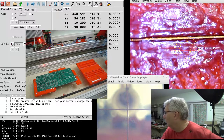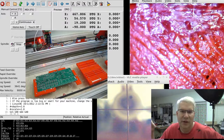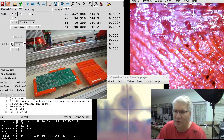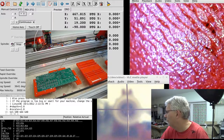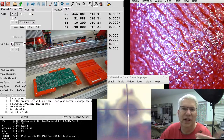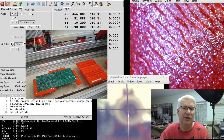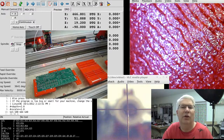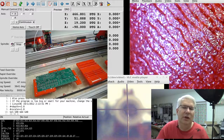You can kind of see it up here — let me move down. It's out of focus because when you do this close focus the focal point is really quite tight. You just move it around until you get that in the center — it does get in focus and a little bigger, and you can see it behind those wires. Then you set its XY position using a LinuxCNC command called G10L20 — it's a coordinate setting system. I set the XY for the coordinate system for the solder paste dispenser tip, and also for the pick-and-place head on G56.